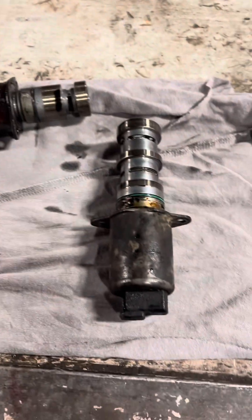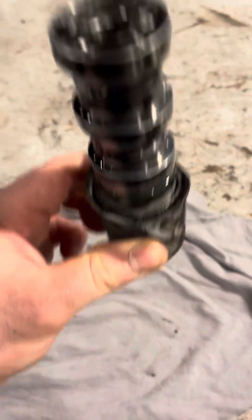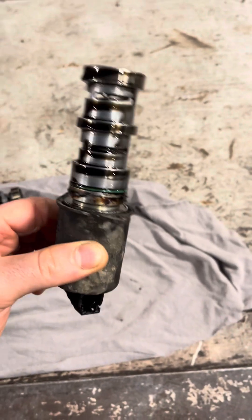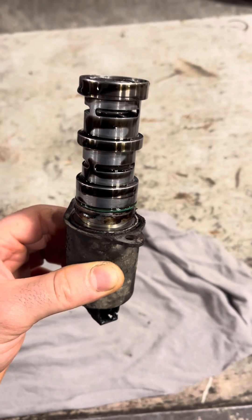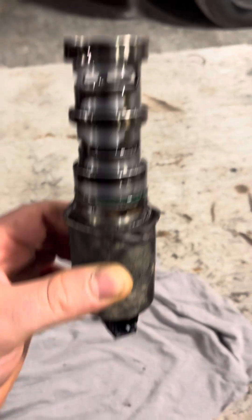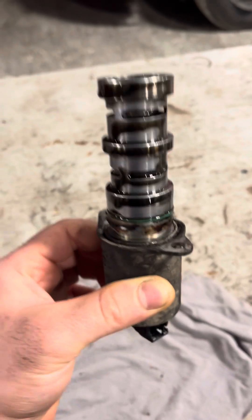This one here is the oil piston cooling jet solenoid. On an MP7, it's usually mounted from the bottom up. Here's a little trick on the MP7 — when you're changing it, it won't come down past the block and a bit of the oil pan. What we do is just grind a little bit away until it passes.